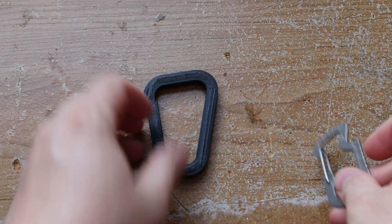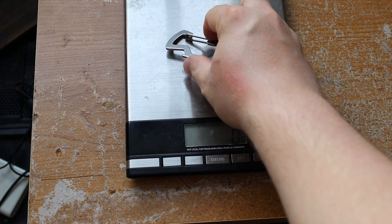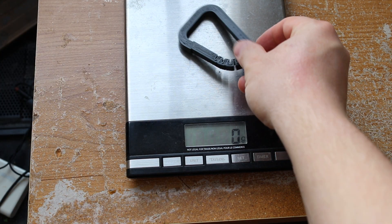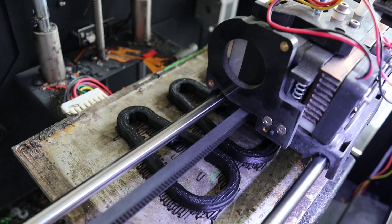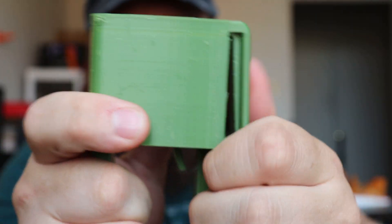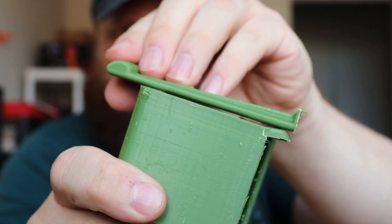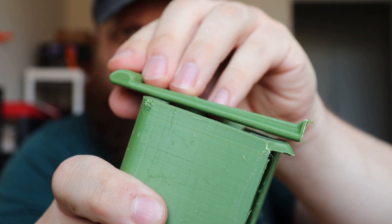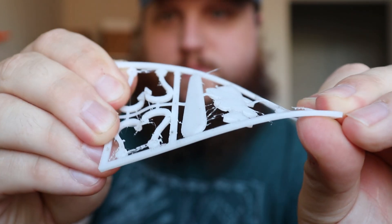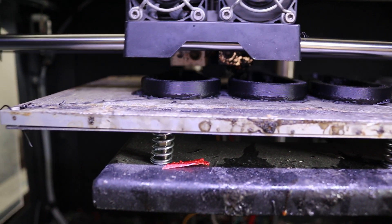The obvious question is: why use a 3D printed plastic carabiner over a metal one? While a metal carabiner might indeed be perfectly fine for most situations, our 3D printed options can be used to save weight and to customize your setup. For a 3D printed carabiner, it's important what type of plastic it's being printed in. Unfortunately, this is just one of those cases where standard PLA, which is the most commonly used plastic on desktop 3D printers, just won't cut it, as it's too rigid and brittle. The carabiner will require something with a bit of flex to it, so I suggest at a bare minimum printing in ABS, which is what all of the carabiners I made for this video are made out of.